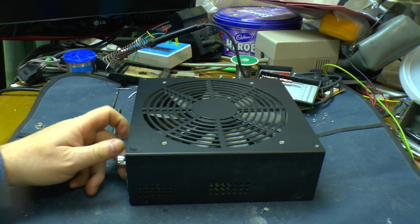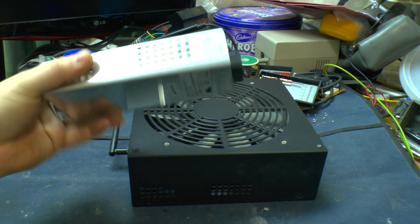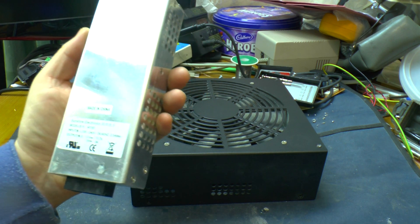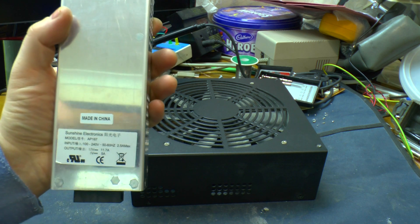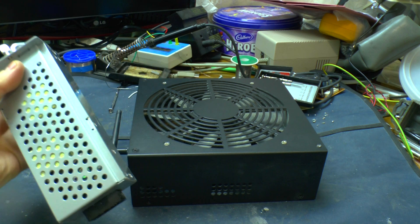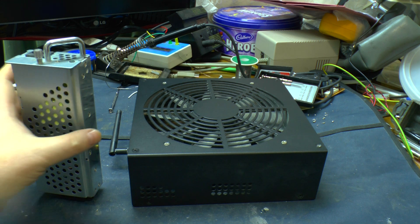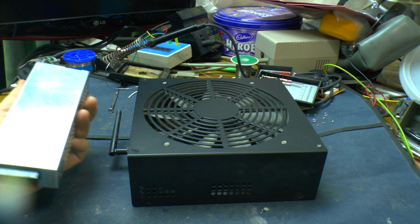What happens is — if you plug in a power lead it blows the fuse in the lead. This is the power supply: it's a Sunshine Electronics AP187, 12 volts at 11.7 amps and 5 volts at 5 amps. I want to take a look and see if I can fix this, though I doubt it — it's a switch-mode power supply, and I don't like meddling with those, they bite.